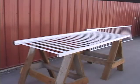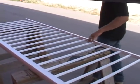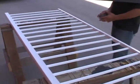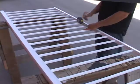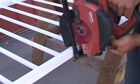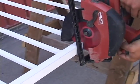With the rail cut to size, we're now going to install our saddle post and our corner post into our front railing section as part of our prefabrication process. To install our saddle post, first locate and mark the desired location where you wish to install it in the railing section. For this application, we're going to install our saddle post in the middle of the front rail section.